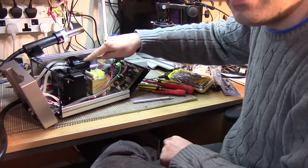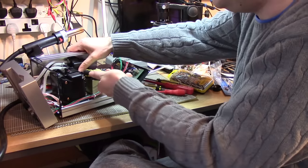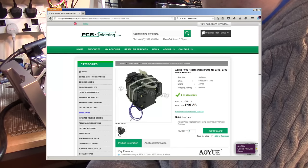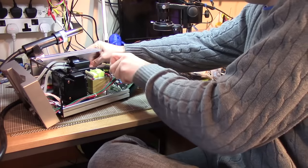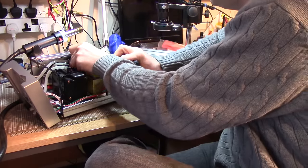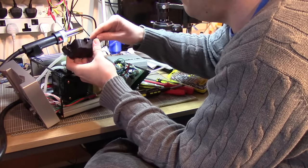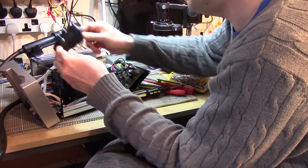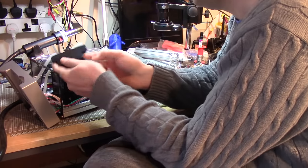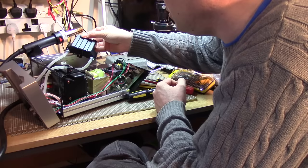Now I can find out what's inside this mystery black box, which I figure must be an air filter because it's certainly not an electrical item - it's got no electrical connections and it is in the path of the air pump. While I've been trying to work out how to get this apart, I've found online that these air pumps are available for £19 including tax. So I think I'll order an additional air pump. I've now identified this part - it says 'pressure equalisation tank for hot air station', so I guess it's just an empty chamber. They're using that to even out the pulsy nature of the diaphragm pump. So it looks like there's no carbon filter to absorb the fumes in this.